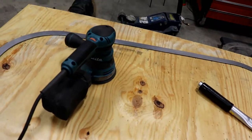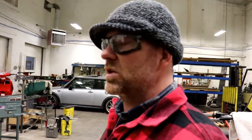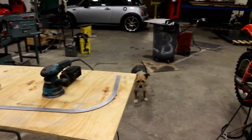I found the best way is just to scrape it and then use a palm sander. The good thing about the palm sander is it doesn't round your edges. If you use a four-and-a-half inch grinding wheel with a flap disc and you're not perfectly smooth, nine times out of ten you're going to round your edges and have divots in your piece. This is one of the major disadvantages of cutting with plasma — the dross. Post-op cleanup time you have to factor in. If you're making one, two, or three items it's not that bad, but if you're making hundreds you do not want to be sitting here doing this. For a small shop with just one person it's very time consuming. But for the price it's hard to beat. Laser or waterjet — you're talking hundreds of thousands of dollars and they're more expensive to run, but you get perfect cuts and virtually no post-op cleanup.